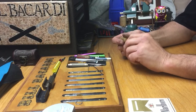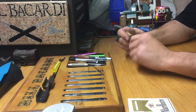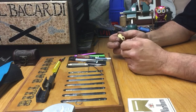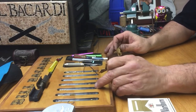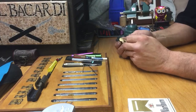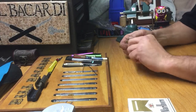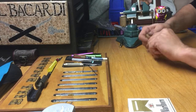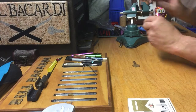I took this 83 series core part. It wasn't working — I locked it up and this key wasn't working it, and I don't know why. Well, I figured out why now. The number six pin, which I have on my board right here — this is going to be a collaboration lock between me and Lockpicking Patrolman — it was a little short, so the driver was sticking down in the keypin.